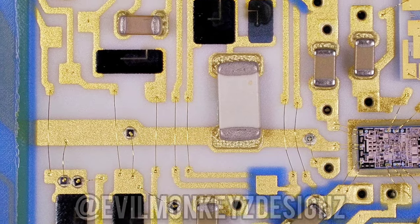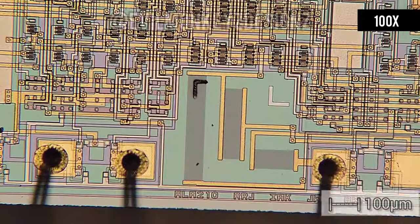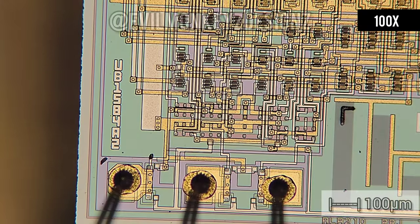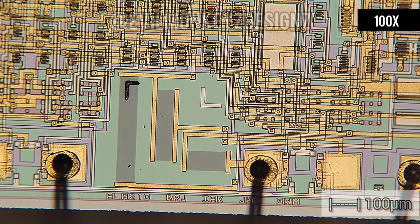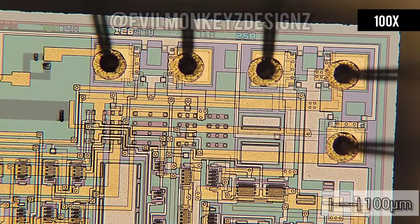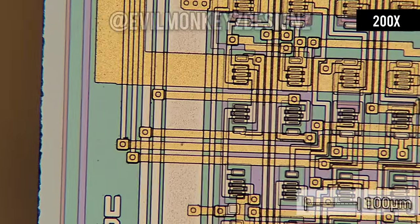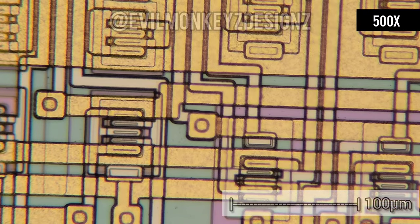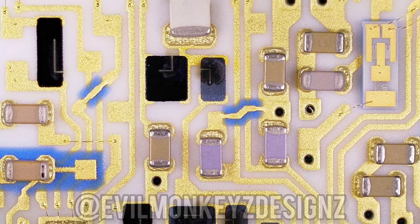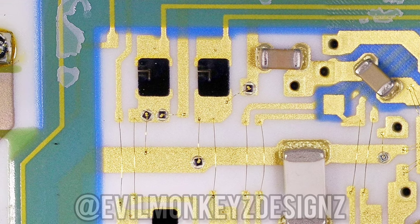Following the output of the HFA-5251, we make our way over to another pair of integrated circuits. This is another chip made by AT&T, and among the numbers included are 1249, UB1584A2, and ALA210, along with the same three initials from the previous AT&T chip plus one new one — IAK. The closest I came to finding out about this part is from the same AT&T databook, which references the ALA201 and 202 as UHF linear arrays listed under semi-custom array products. It's very possible that the ALA210 is another device in this family. The databook also lists AT&T's custom capabilities, so it's not too far-fetched to think these were all custom designs for HP and this specific application. The AT&T databook is also linked in the description.